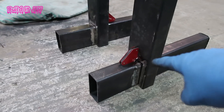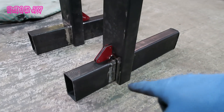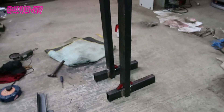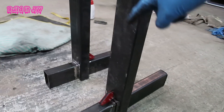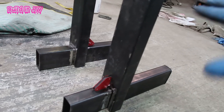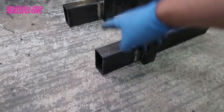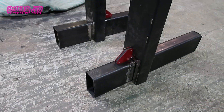Now we've got our grooves cut out at the bottom — you can see how the leg is going to sit underneath fitting in — and then we can weld all the way around both edges on there and that's going to hold it nice and tightly. I want more footing at the back of the bender because all of your bending motion is going to be pushing upwards, putting the weight more on the back. I'm also going to pop a hole in here and a smaller hole in the bottom so we can drill down through and secure this into the floor, keeping it nice and sturdy.